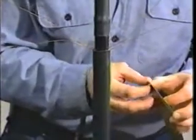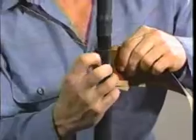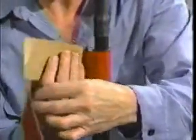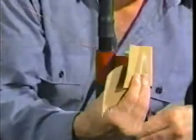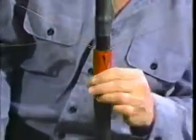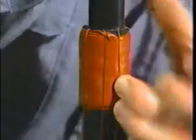As with other cables, clean the jacket with an approved solvent. Remove the backing from the red sealant. Using light tension, wrap 2 layers of red sealant onto the jacket under the drain wires. Lay the drain wires evenly back over the jacket and press them into the red sealant.